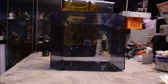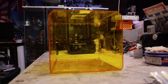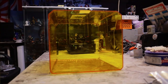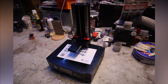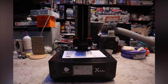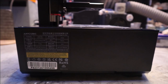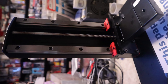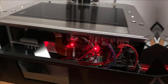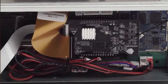Not a fan of the new UV cover — it is lighter, flimsier, has a cool blue color, and a cutout in the rear for a tank heater. Would rather retain the old cover, but for a reduction in price, happy to keep it. With shorter rails you have a shorter printer with the same printing capacity. The Z-axis screw and stepper motor are solid and reliable inside the body. The bottom box uses a lighter material with more plastic than steel, with the same vent placement and vertical standing motherboard to prevent damage from resin if a vat leak occurs.